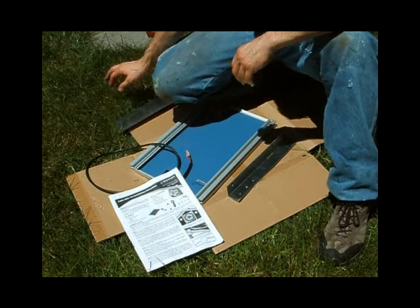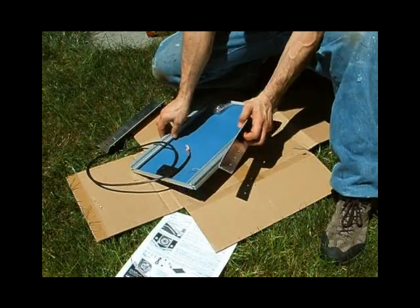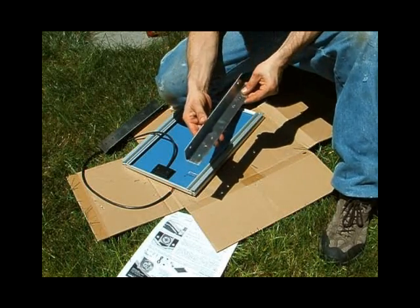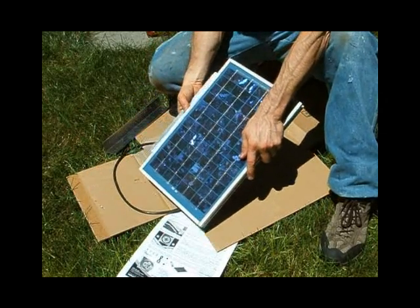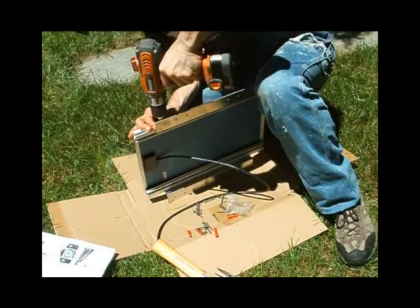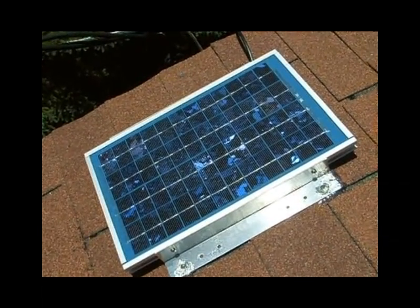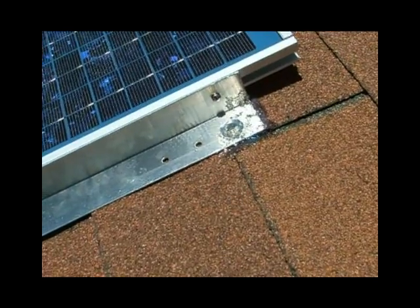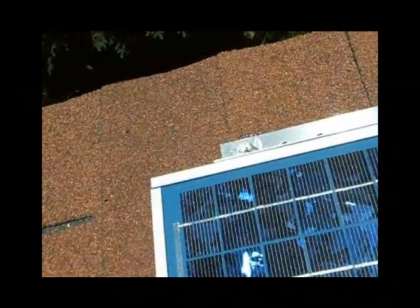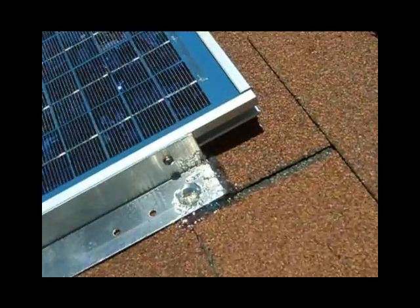The photovoltaic module kit includes instructions, the module itself, and a bag of mounting screws. The first step is to attach the mounting brackets to the module. The angled metal brackets have pre-drilled holes for joining the module to the brackets and the brackets to the rooftop. There are also holes in the module frame which line up with the bracket holes. Attach the brackets so that the module will face upward into sunlight and will be slightly raised off the roof surface. Here's the solar module installed on the roof. You should only go up on your roof if you feel comfortable doing so, not to mention making penetrations through the roofing. The mounting kit included a full caulking tube of roofing-grade silicone sealant, which I used generously in the pilot holes for the screws, on the screw shafts, where the bracket meets the shingles, and also on the tops of the screw heads. The screws provided aren't very long, but they're long enough to go through the shingles into the roof deck — better safe than sorry.